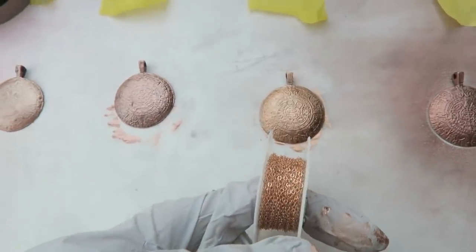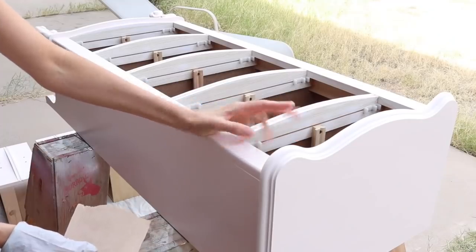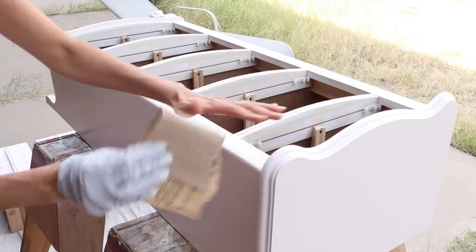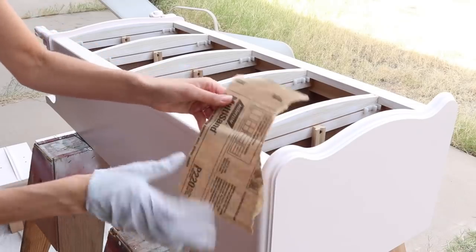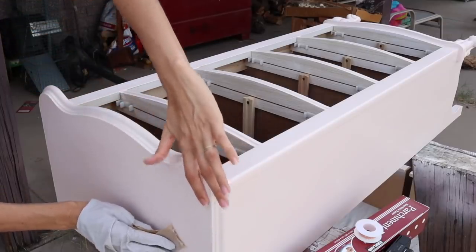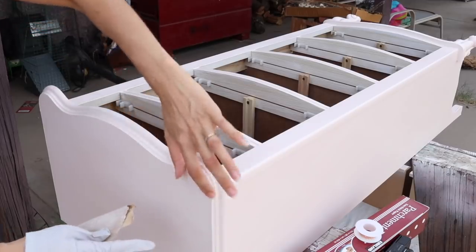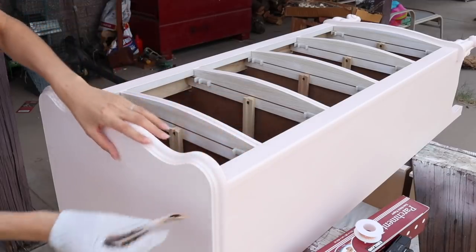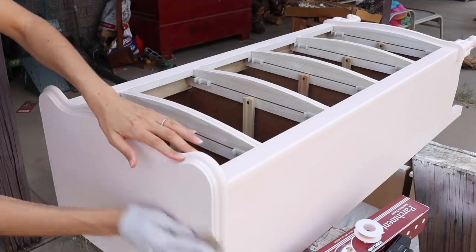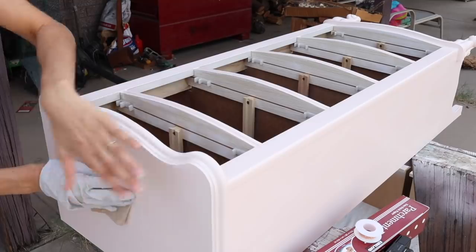I think that's the winner — FolkArt Treasure Gold! Okay, we did two coats of primer and I've got one coat of paint on here, all dry and ready to sand. I sand in between coats using 220 sandpaper. You're really just smoothing out any bumps or lumps, anywhere the paint overlapped over the edges, or any drips — just smoothing those out. It's not like you're sanding off the coat of paint you just put on; you're just smoothing it out.